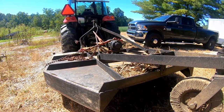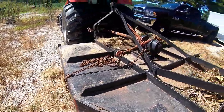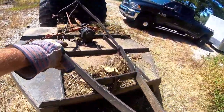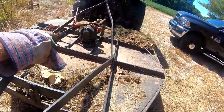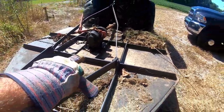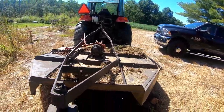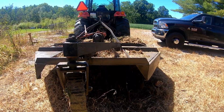Okay, so have that hooked down to the lip there. Under the brace, have this chained off, hooked to the loop. So what we should do is twist it back whenever we tighten that binder.